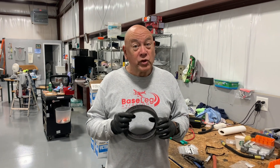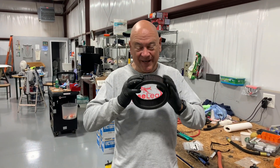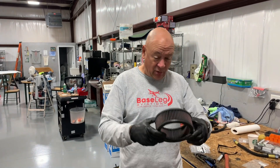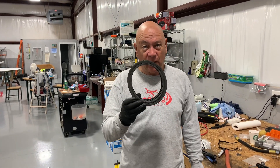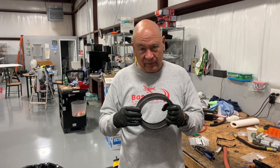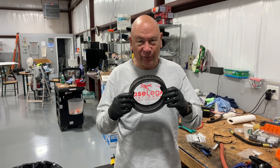Another friendly reminder: air filters are not lifetime parts. I'm pushing as hard as I can and it won't bend — it's at about 66% of the normal flow of a new EA3450 air filter. Change them out at least once a year. They're only $50 and they're protecting your $50,000 engine.